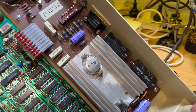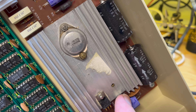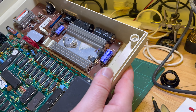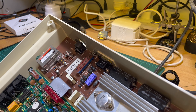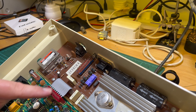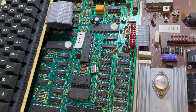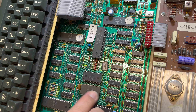I'm wondering about the 7905 - they don't have it tied down to the heat sink, they just have it kind of sitting there. That makes me think they don't want it touching ground, but it's a bit dodgy. Apart from the modulator being smaller, we've got a different color plug. Same amount of memory - two lots of 16, lots of 2K chips. This chip here is ceramic whereas the other one was a Texas Instruments chip.